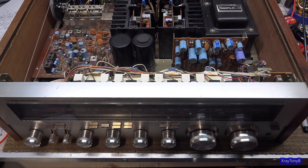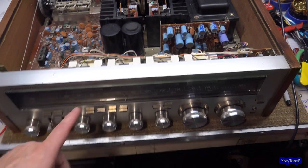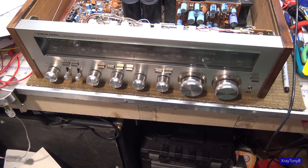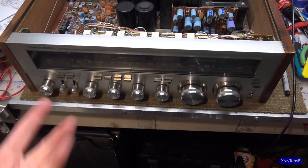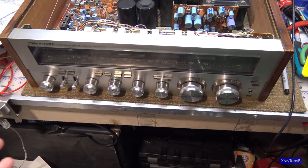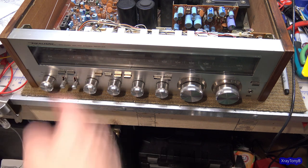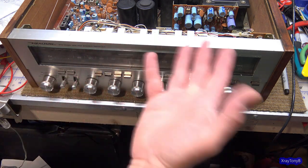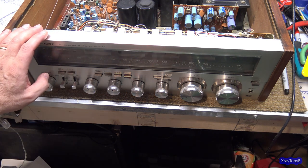If you connect this stereo to a 4 ohm speaker, these meters will not read the correct wattage. They'll actually read half of what they should, because of Ohm's law. I hope that makes sense to all of you. There's nothing fancy about these. There are meters with really elaborate metering circuits that can track that, but you're not going to see that in the average stereo of this generation. This is simply a voltmeter that bounces around and measures the volts. It's checking the RMS voltage, and the scale is written based on an 8 ohm load. So now that you understand how that works, let's go through the process of how to set it.